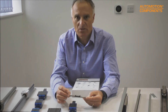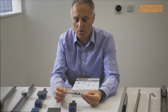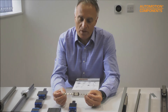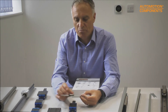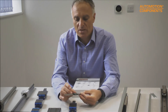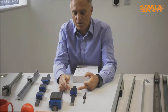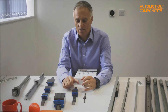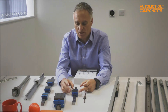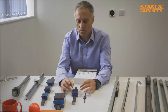The stainless steel units come in different widths from about 3–4 mm up to about 20 mm wide, generally supplied in one-meter lengths. Stainless steel makes them much more freely moving. The technical term for this is preload — the higher the preload, the stiffer the movement. A K1 preload is standard; K0 preload is more freely moving. We stock both, though the seals always create some frictional resistance.